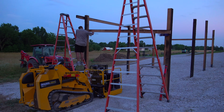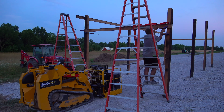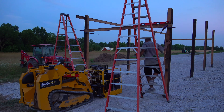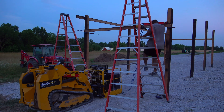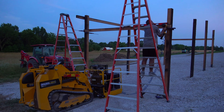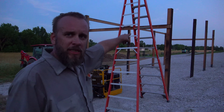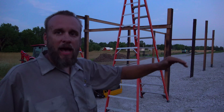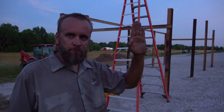I'm waiting on some new leveling tools but I don't like to wait when I want to do something. By measuring down two feet off the front and leveling that post, then measuring from that girder, it's eight foot on both ends — pretty darn square, square enough for me. I'll snap a chalk line from this end board to that one, and that will be the height of the back inside. I'll have an 8-foot-6-inch ceiling on the back and 10-foot-6 on the front. The tractor is 8 foot 2 inches — that means I can park it in this shed.